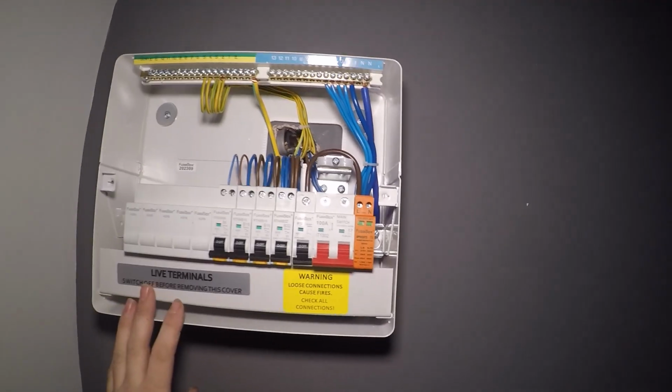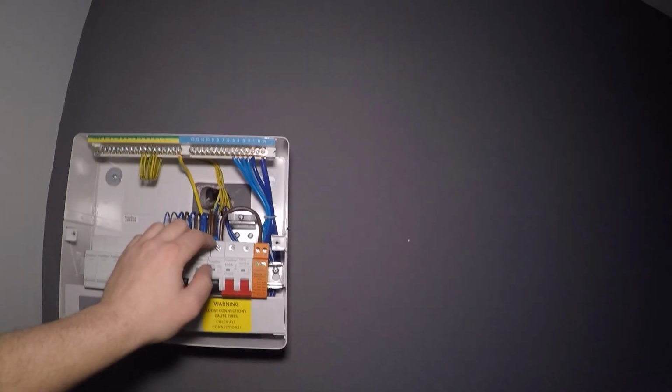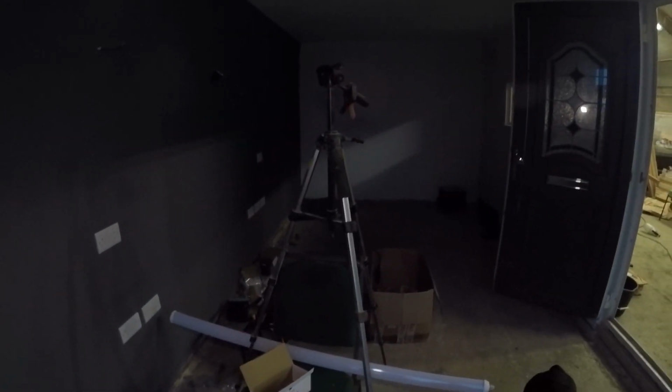But done, dressed in, ready to go, bar the fact obviously the supply is still missing, so for now, the supply is going to be like everything else. There we go, we'll put the office on a plug top, just so we got some bits working in here. Actually no, I might have to upgrade that, it's like 0.75mm flex or 0.5mm. And I probably want to plug a heater in, so yeah, we'll change that. We'll actually do it properly. Ish.